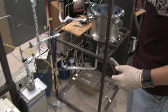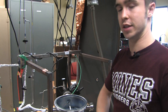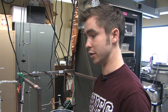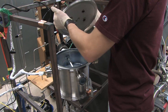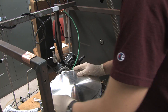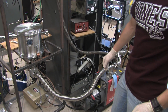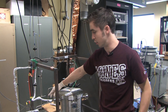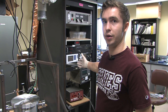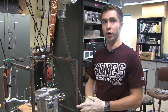Roughly, the thickness of the film that applies to the ceramic tube is about three times as thick as on the silicon samples, so that's how we can estimate the film thickness on the tube. The lid is placed on, oxygen is pumped through the bottom, the chamber is evacuated using this pump, either molybdenum hexafluoride or molybdenum hexacarbonyl is pumped through the side, and setting the plasma to about 200 watts we begin the reaction, which normally takes about one to one and a half hours.